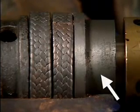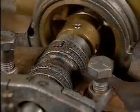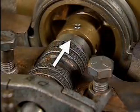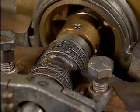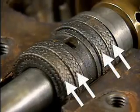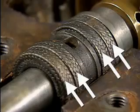The throat bushing is the component of the packing gland that is closest to the impeller. It prevents the packing material from being forced into the suction eye of the impeller by the gland follower, which is the component that compresses the packing material. The packing material provides the seal that controls the leakage between the shaft and the pump casing.